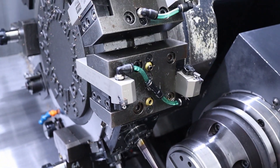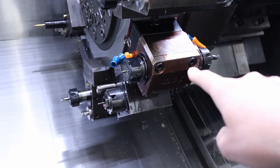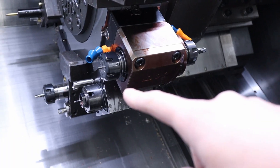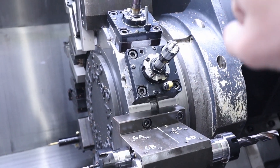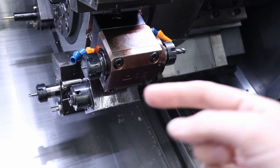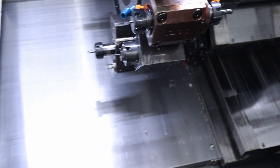We already have a fairly long extension off the turret, so I'm going to have to keep making it the way I used to. This right here is an axial style live tool — it's a double ender — and this will allow me to do the milling I need to do today in conjunction with some of these radial live tools. Those are called radial because the tools exit the turret radially, and these ones are on the same axis as your main spindle.